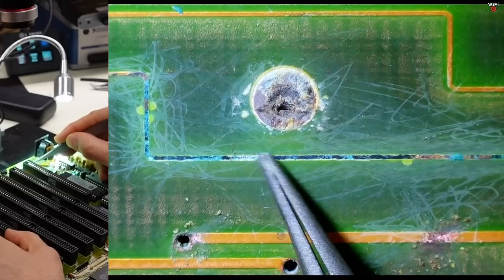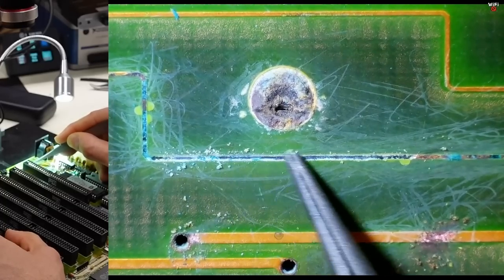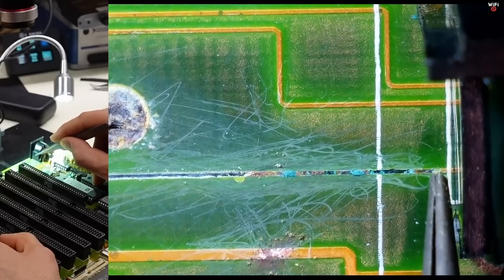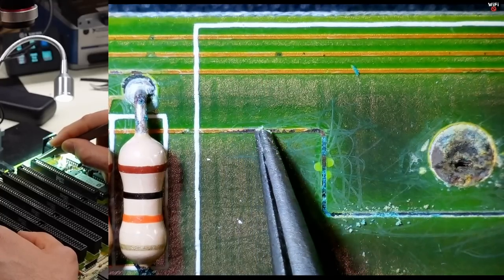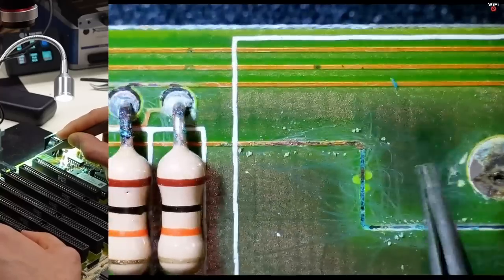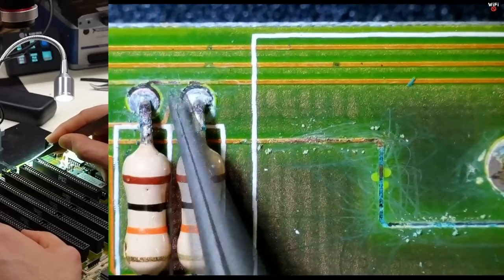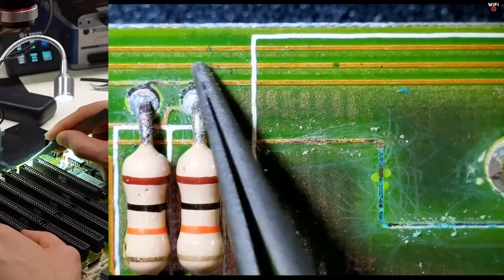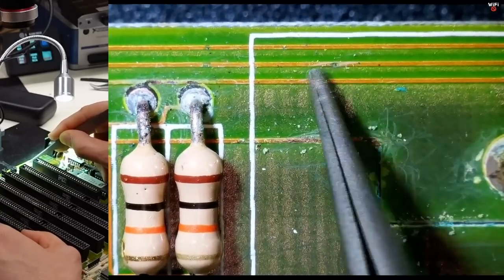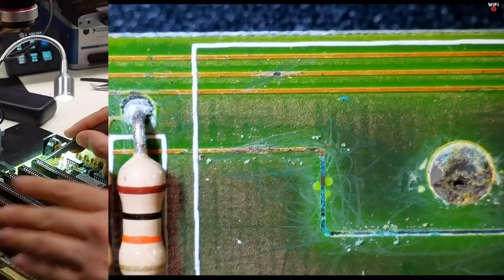There is a trace that is simply gone from this board — it is just eaten away. So at minimum, I'm going to have to bodge over this trace. We can see there's probably copper under there. Obviously these resistors have seen better days, but I'm sure they're actually fine — we could just scrape this crud off of them. But you can see that even these traces up here have little spots of corrosion, so we're going to have to check all of those with the pointy probes on the multimeter just to verify there is actually continuity.